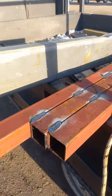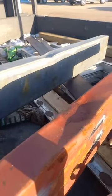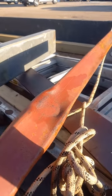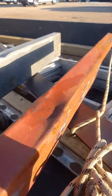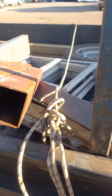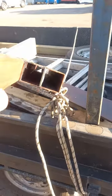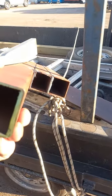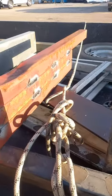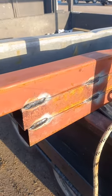I did the same test — put it into the press. As you can see, we've got the deformation again, but this time it took 30 ton of pressure to do that. The amazing thing is it's as straight as an arrow. That bar there has got a slight amount of bend in it, but it's neither here nor there.